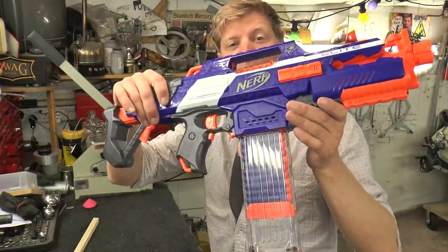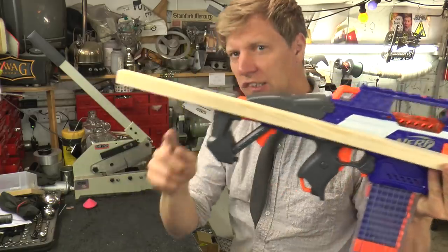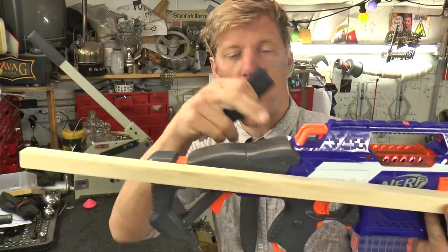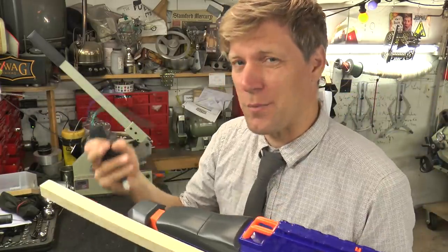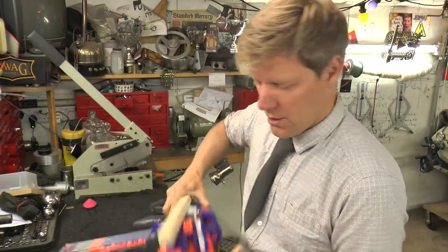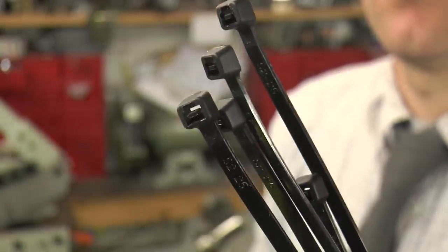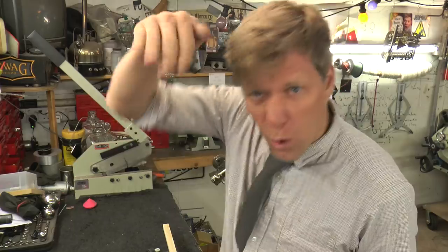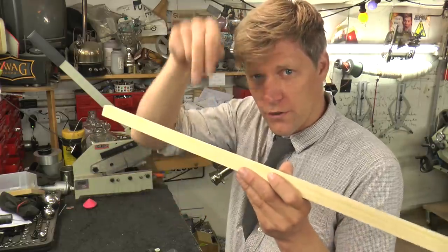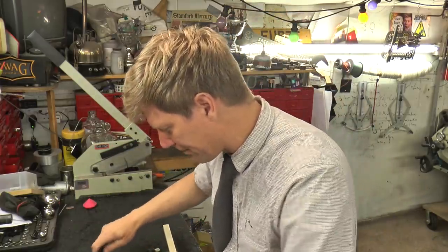Next job, we need to work out how we can stick the gun to our base. Got a bit of 20 by 20 wood and we're going to attach that to the side. It needs to stick out over the back to house our little actuator unit. Now depending on what model of gun you've got, you might be able to mount it somewhere else, but for this to be a more universal how-to, I've found hanging it out the back seems to work with all models. The best way to attach this piece of wood is either jubilee clips or zip ties. Depending on how wobbly the gun is, you may need to get a little screw with some washers to get it sitting flat. Let's get that fixed on.